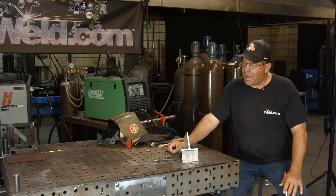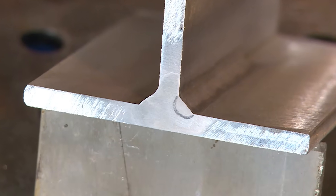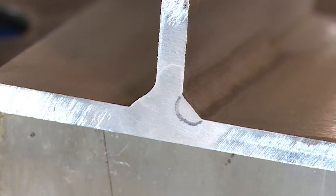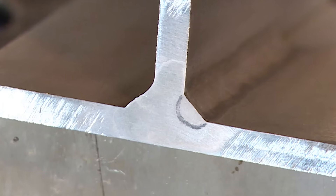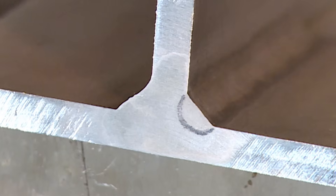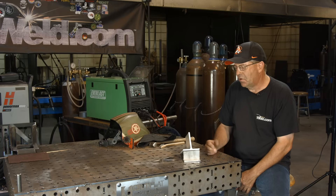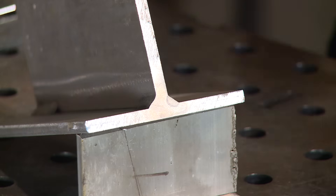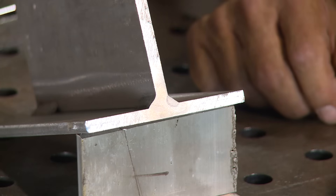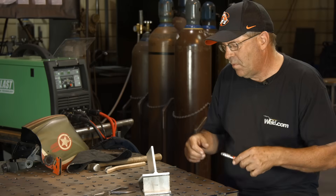Welcome back. I went over and sliced about three-eighths off the end here — I didn't want to go too far in because I wanted to catch the start. I didn't have any oven cleaner, which is the cool stuff for aluminum etching. The college doesn't want me to have acids and etching solutions on campus. But I put a pencil mark around here and it did show a nice round depth — it got down in there pretty good. We could have preheated this and probably done a little bit better. The whole demonstration is quarter-inch thick aluminum with DC on fairly light amperage. Could I have gone higher in amperage? Oh yeah, I could have cranked it up and gone hotter and faster. I just wanted to do a demonstration of something synonymous with what you might have at home.